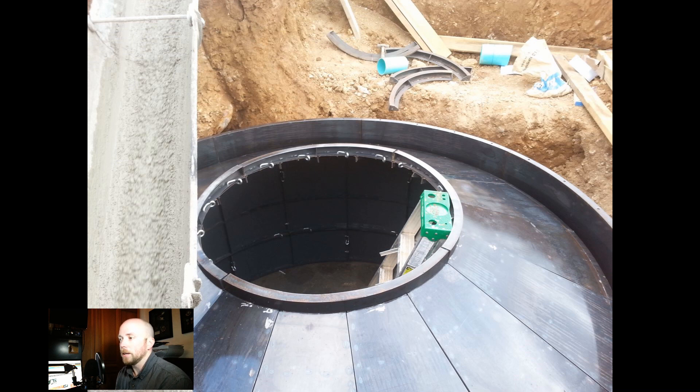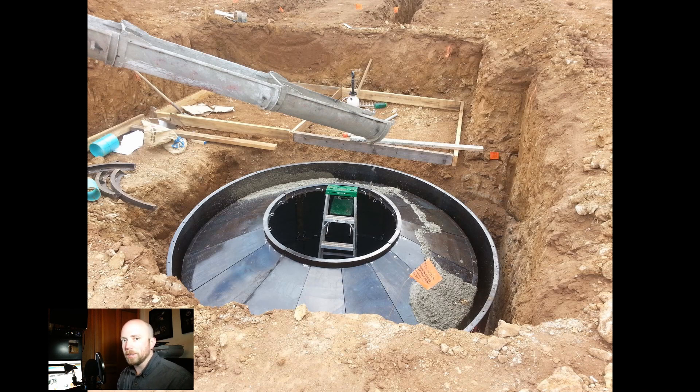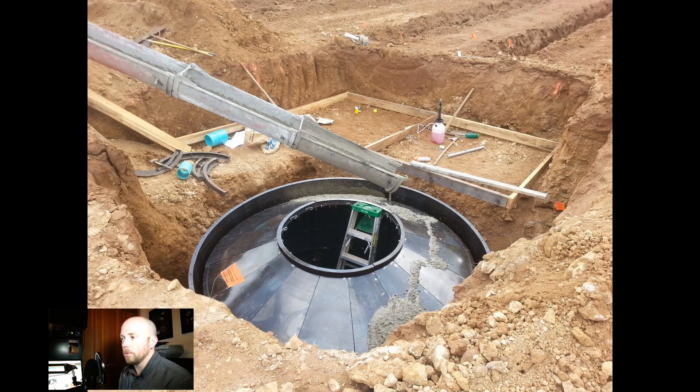Now we have the digester stomach — it's a multi-piece frame with an inner and outer frame, and you pour cement in between them. One thing we learned is that the pour really wasn't meant to happen as quickly as we tried, causing some hydraulic lift, so we had to slow the pour way down. If you ever build one of these, make sure you go slow. The inlet and outlet pipes were placed by cutting into the wet cement.